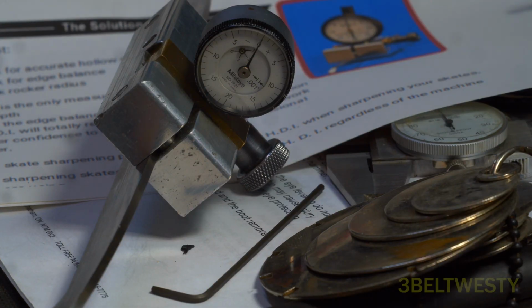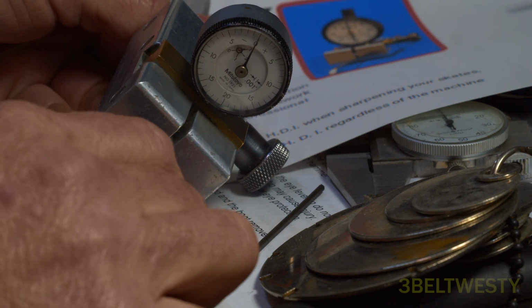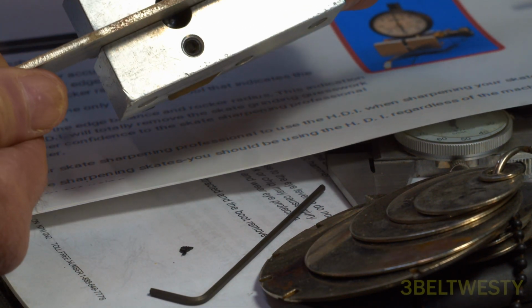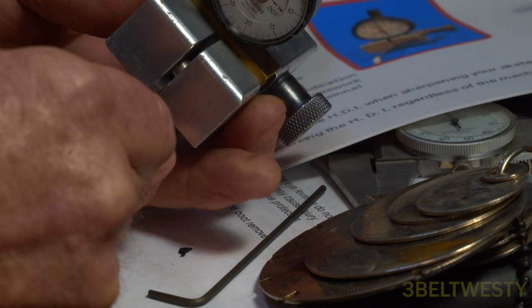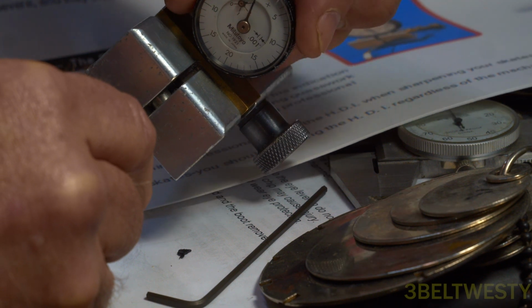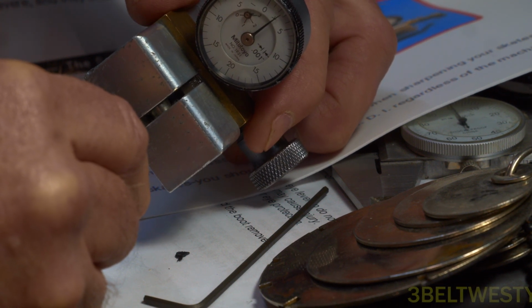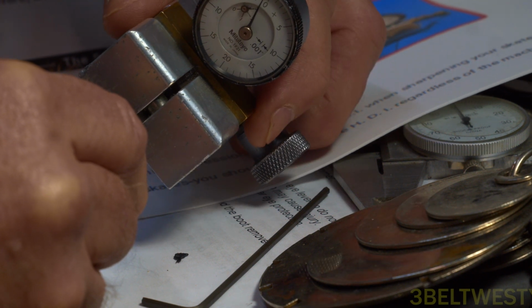Okay, these hollow depth indicators were originally made by Edge Specialties and Company in Minnesota, and then they were sold a few years ago, I think, to Wissota because the owners retired, Jan and Brad. And then the way this is used is you clamp a blade in here. It's got a gap. And then this brass piece will traverse back and forth like this. So if you set this up and move this back and forth and look for the minimum, I'll set that on 0, and I can go up here, and this goes up to roughly 3, goes to the minimum, goes back up to 3. So the center of the hollow is 0, and I've purposely rotated the scale around, and then I've moved this up so it reads 3.